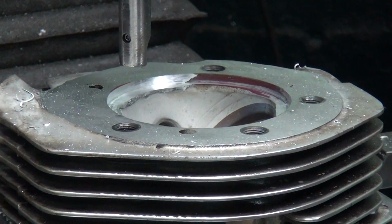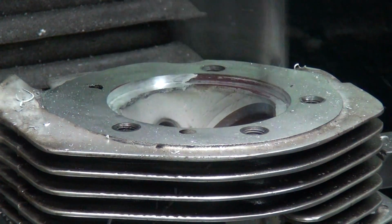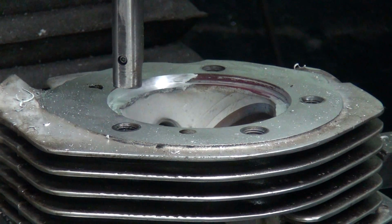And we're already starting to hit over here, so I'm going to swap this over. X can go over slightly. Oop, not that much. Alright, a couple light adjustments on my X and Y. One more thou.